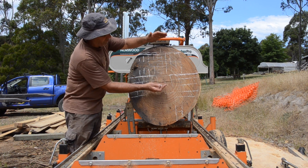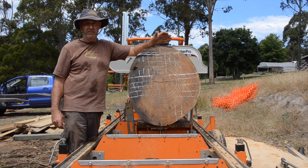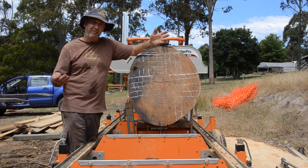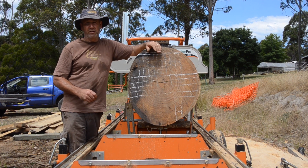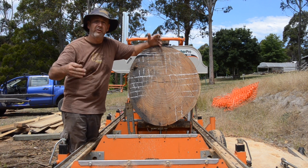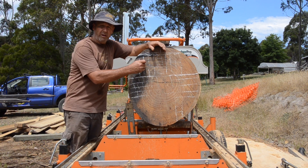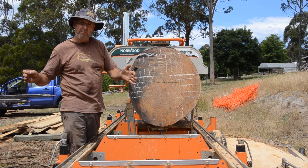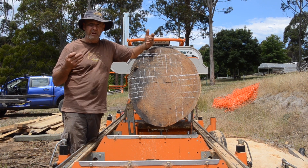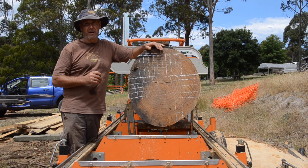The width of the boards will vary a little bit depending on what I can recover — between 5 and 7 inches across. And for that product, given it's from a pruned log, I'd be expecting about $2,500 a cubic metre after it's dried through the kiln. There are a number of steps in that process which cost me time and capital, but the quality is such that in a tabletop this timber won't move as much, it won't tend to cup during drying, and it will be a higher quality timber.